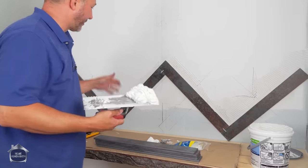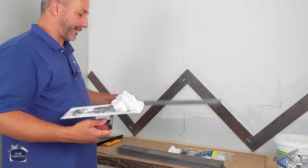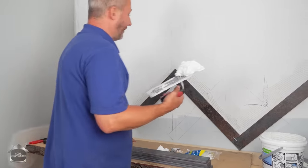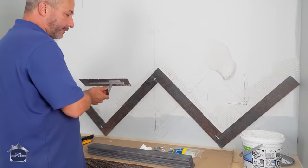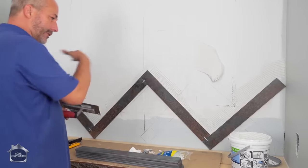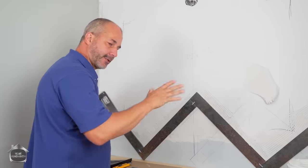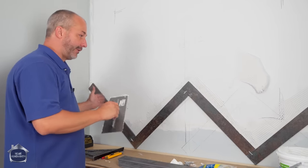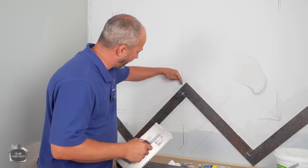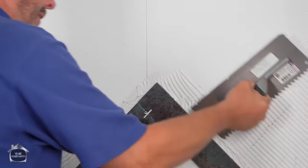In this particular situation, this is a 5.5 foot wall. So consider that if you're going to get these 23¾ tiles. Wow, I might have to remember that math for the future. This is a great design element. Now, if it doesn't fit, of course you have to cut the edges on both sides, right? Balance it out. Because in this situation, if, let's say this tile was a little bit too long, and I started with full pieces there, and this side had all the cuts, it would start to look a little bit odd. So you really want to balance it out. But you can see that my center line travels through both of these tiles, because that's the true center, even though the tip of the W is offset. Anyway, just a little tip there.